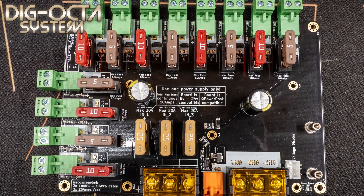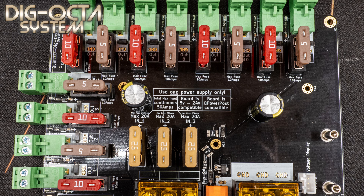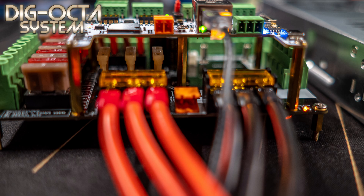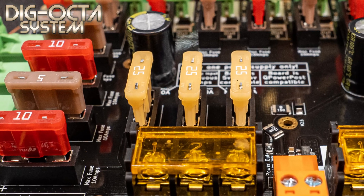All boards have input fuses and output fuses. Once you start upping the amount of power and have multiple links between your power supply and a power board, it becomes more important to have input fuses. With an even split of three like on the normal power boards, there would be about 16 amps per cable. Always use the same size and length wires for all three — that's important to remember. If one or even two cables come loose or short circuit, the power supply will still try to provide power, overloading the remaining cable. The input fuses prevent such scenarios and make sure a fuse is always guarding safety.